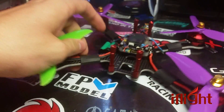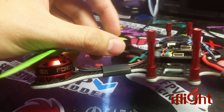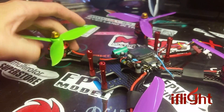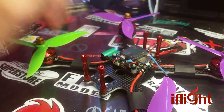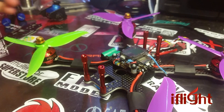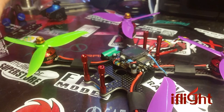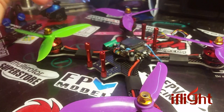As far as performance goes, you'll notice I don't have this dampened — there's no soft-mounting on this whatsoever. I didn't soft-mount the motors either. So no soft-mounting whatsoever, but I'm still running 8k/8k refresh with no problems. I am running D-Shot 600. Side-by-side with my multi-shot-enabled twin of this, it's great performance. It works very well — I believe it's like 4% CPU load, and I've turned nothing off.